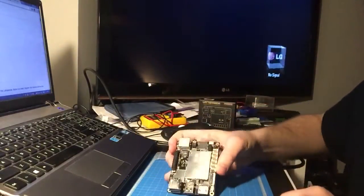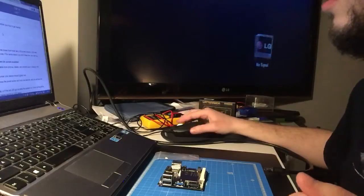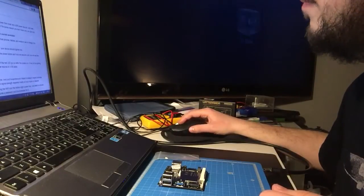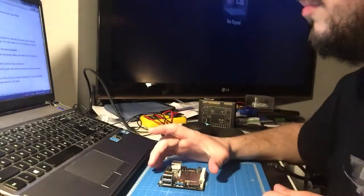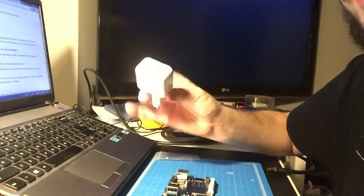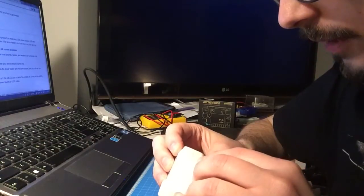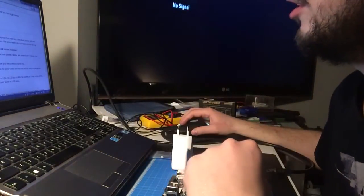Okay, so now I am on the website on my computer. I was reading some stuff about it before, so I kind of know what I have to do, but I prefer to read their guide. They say the LattePanda micro USB connector is used to provide power from most any USB power source. USB adapters are probably littered all over your house. Yes, exactly. I actually have the one from my iPad, which is 5.1 volts and 2.1 amperes. So I guess it's fine because the documentation says that you need 5 volts and 2 amps.